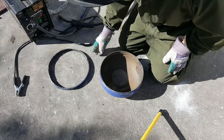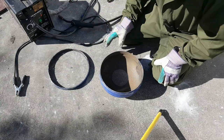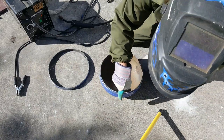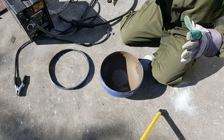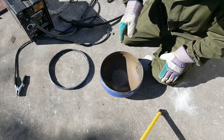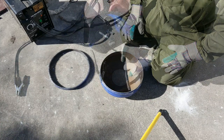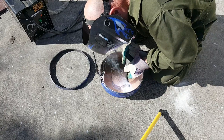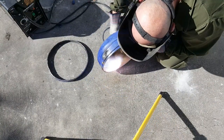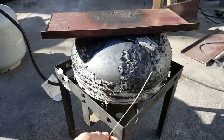Sharp edges cleaned up. I did the math on the circumference and cut three quarters of an inch out so it would fit on the inside — this is just going to act as a guide ring so that later I can set the top on and weld it from the inside, because the refractory mix is going to be around the outside. And that's how to remove paint.